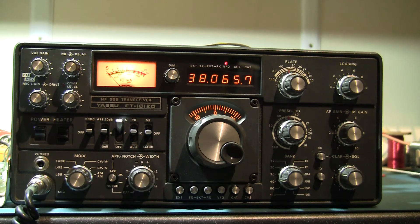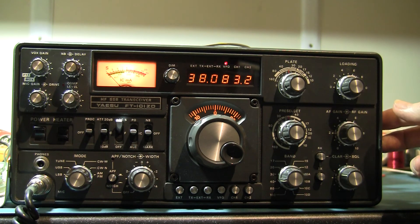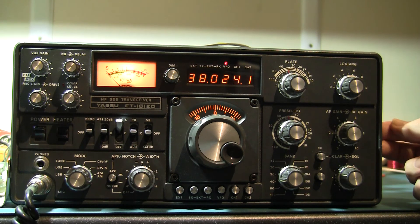If we wait long enough the oscillator will probably warm up again and come back to life. We'll sit here and wait another 10-15 seconds or so and see whether it kicks in, at which point the display will read 7.1MHz because the heterodyne oscillator will be running, converting the VFO frequency to the required frequency for the first mixer. I could probably speed the process up by touching the crystal with my finger, which will warm it and also give the oscillator a bit of a kick so it might just kick in.